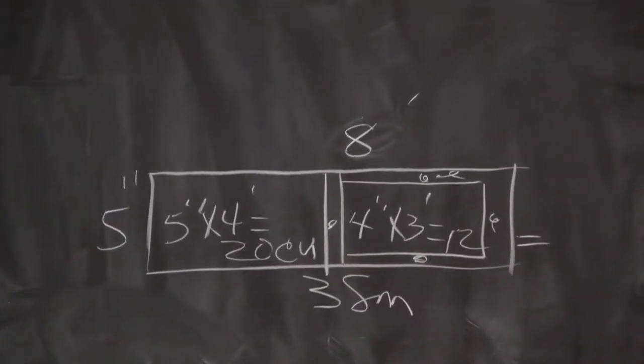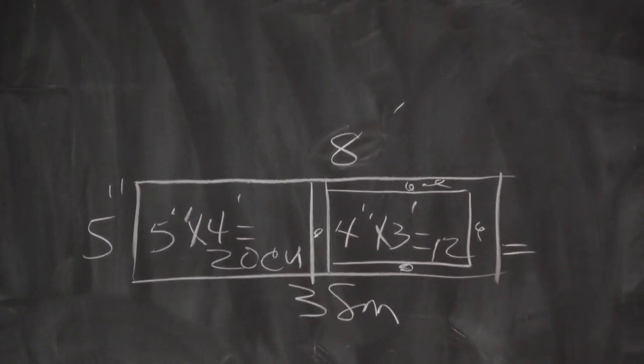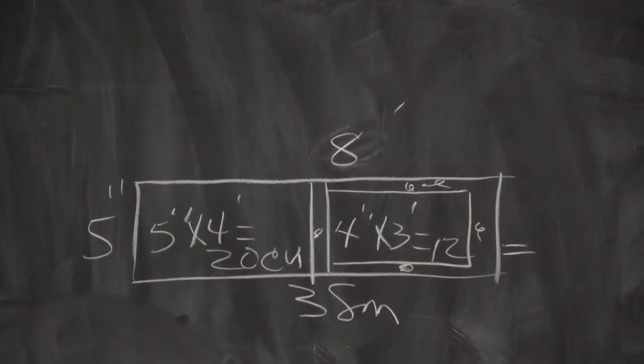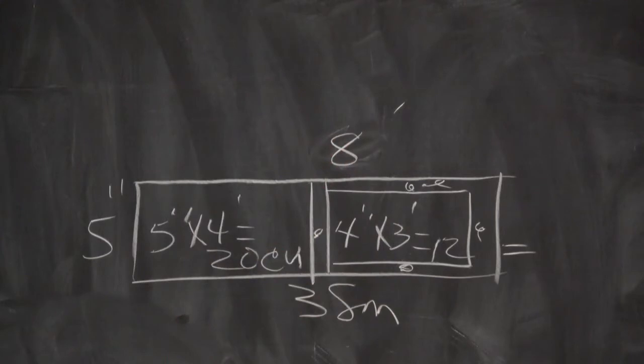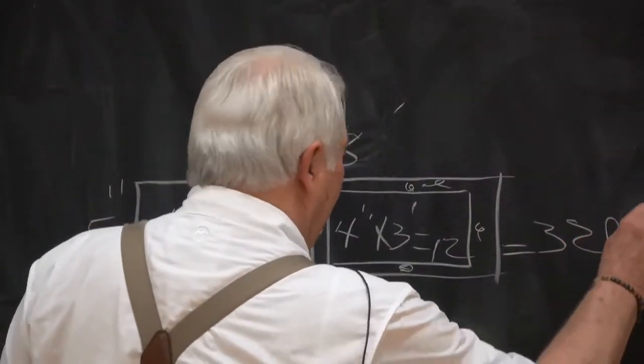Okay? With a 3 foot surface measure, extra cut, extra yield, number one common, you need 27 cutting units. You got one cutting here, 5 inches wide, 4 foot long, you get 20 cutting units in one cut. Well, that's not good enough for one common. Extra cut, extra yield, you come over here and get that, and get 27 cutting units. That will make a one common whatever, but this makes an FAS walnut. 32 cutting units. I just made that one up, but anyway.